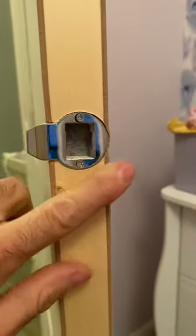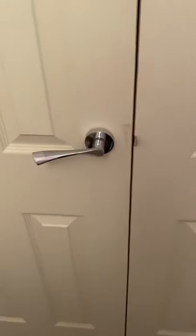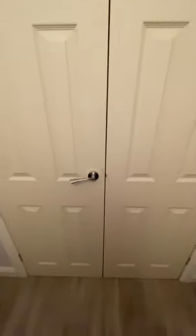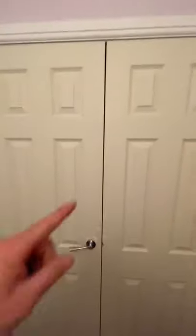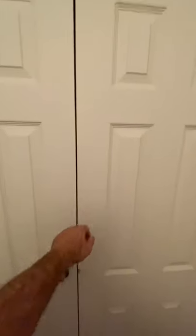There you go — again, nice and flush, flat. Nice little housing in there — that's the finished product. Tomorrow I'll get a door jointing strip on the other side: with double doors it closes onto the jamb, so to get rid of the light gap when the light's on in that room, we'll add the door jointing bar. Also a little latch that goes up into the door stop on the other side, just to keep one door from opening when the other one is being used. So there you go — that's a quick video on how to swing doors and fix the handles and receiver plate. If you've got any questions, just drop a comment and I'll get back to you. As always, share, like, subscribe and keep posted.